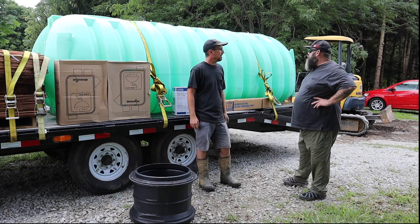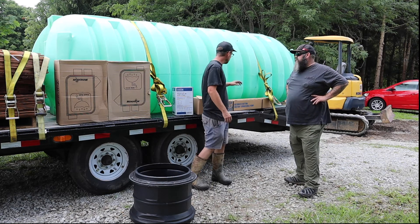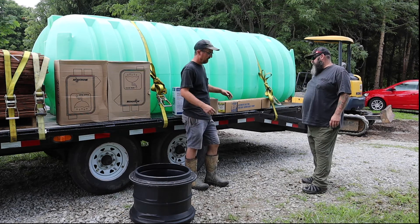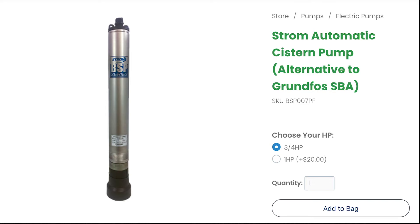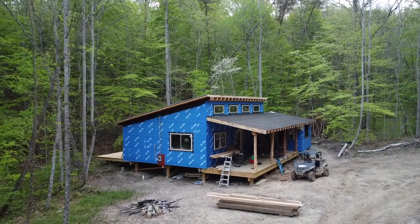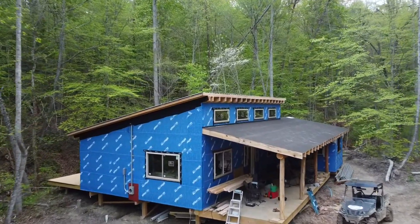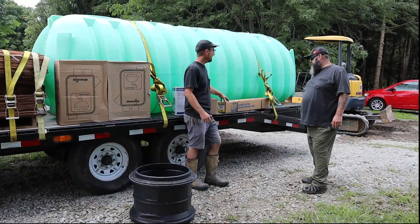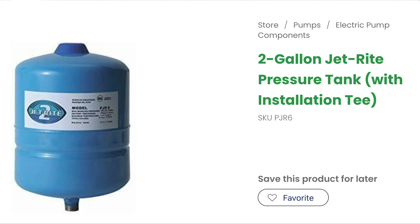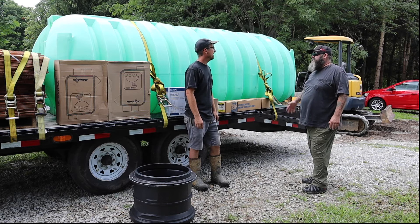You guys sell complete kits online, and parts as well. We have tanks, and this is an automatic cistern pump. It's a submersible pump specifically designed for an application like yours — a cabin build, not a permanent residence. You don't have room for a pressure tank inside your structure. This is an automatic pump that just uses a little two-gallon pressure tank to supply constant pressure to the house.